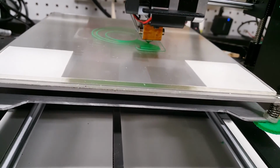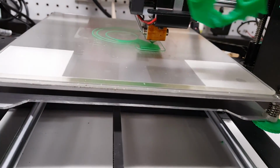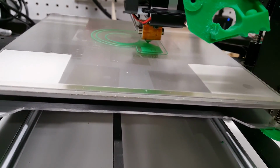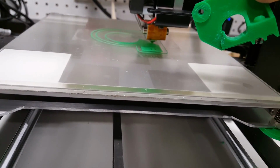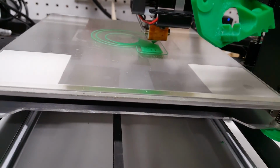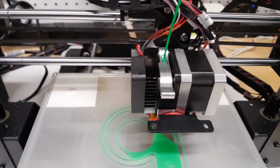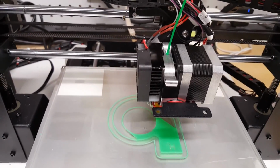One of the mistakes I made when I was doing this, and I actually cut it out of the video, is I had a different sort of extruder feeder block that I had installed. And you can see I filed the heck out of this trying to get this to fit. And the first time out, this did not print very well. It was because I tried to do these two mods at once, which you should never do. The idler wheel on the other side of the extruder gear was pinned against this due to a tolerance issue. So that's resolved now. I put the original back in. It's working just fine. I did install the new all-aluminum lever there, and that's working real nicely. Looks nice, a lot less slop in it, and I'm hoping for some generally cleaner feed.